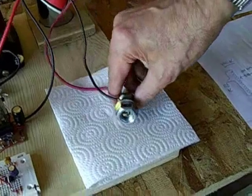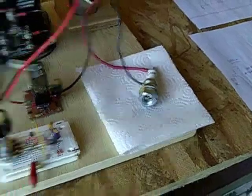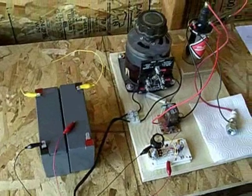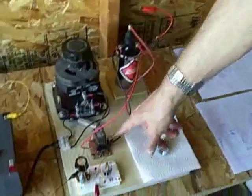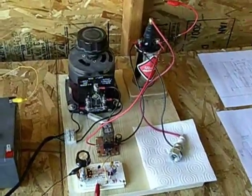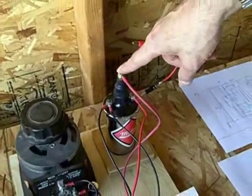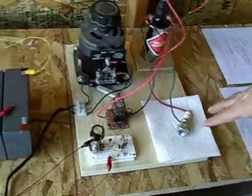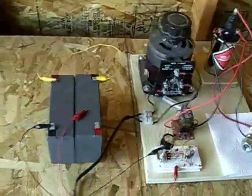So we've got this thing in this little thing so you can see the spark. The first thing I'm going to do is run this thing in 3 modes. One, standard mode, where we're just discharging the cap into the coil and running the spark. The second mode will be to include the diode in the circuit between the low voltage plus and the high voltage plus, and see the difference in the spark. And then the third aspect is we'll spray a little bit of water into the spark and show you the difference there. So those are the 3 modes that we'll run the thing in.